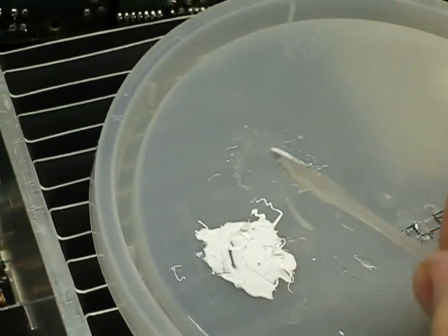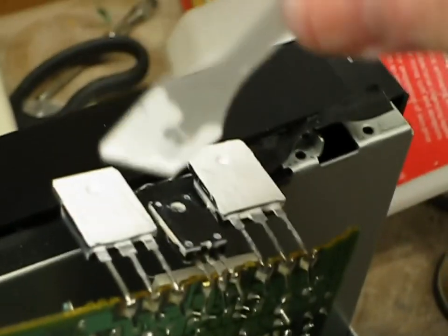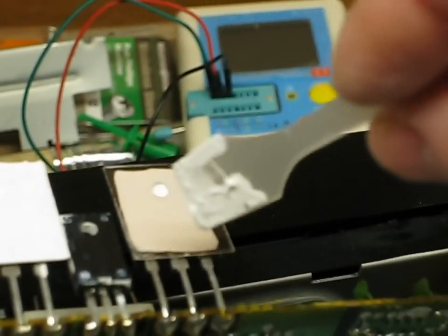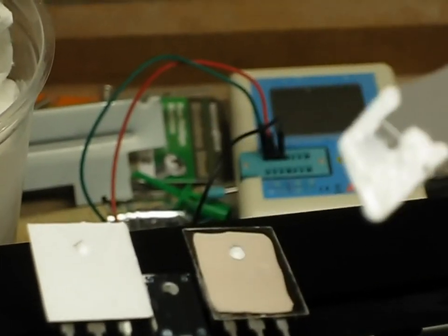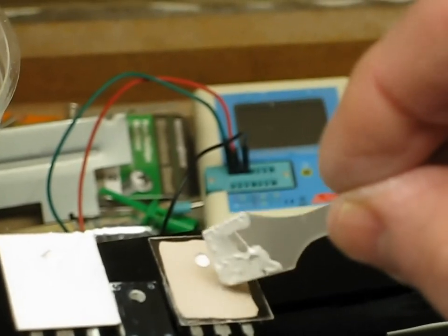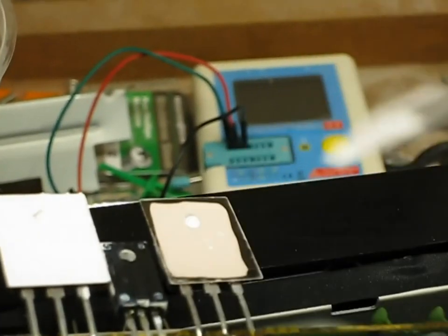Here's how I do the power ICs: I don't work from the tube — I put some on the surface and spread it evenly across the ICs, going down each one. The paste is thick but still somewhat fluid so it'll start to level out. Then I put the insulator on, line it up with the hole, and work my way down to push out any air bubbles for full contact with the insulator. Then I carefully smear the insulator with more thermal compound — you have to do both sides. Once the paste is there it'll pretty much stay put, and you can nudge it back into place if needed.